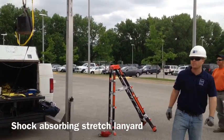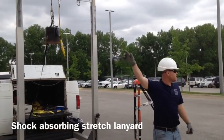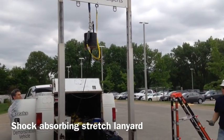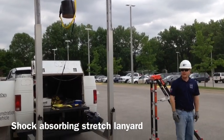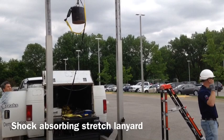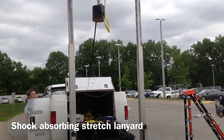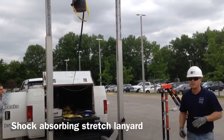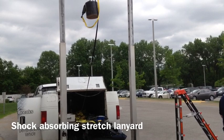What I want you to remember — we talked about that fall clearance and how many feet we needed. At the base of this, at that anchor point, it's 12 feet. So if I'm standing underneath here and looking up, or if that's my feet at the top and I'm looking down, it looks like I have a good distance. Keep that in mind when we drop this here. As a manufacturer, we want to be the two-times-four. You'll notice on all your equipment it's going to say an average arresting force of 900 pounds. That's where we want to be in that ballpark.